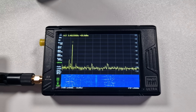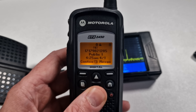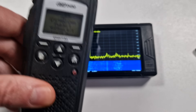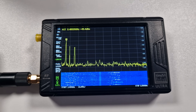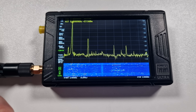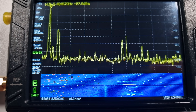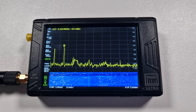Back to the Motorola DTR2450. How is this different? The best way to show you is on the spectrum analyser again. What we're looking at here is 2.4 gigahertz to 2.5 gigahertz — that is the frequency range these DTR2450s operate within. You might have noticed that is actually the same as Wi-Fi. So when we look at the spectrum analyser, look, we're not even transmitting anything yet and you can see this is just full of signals pinging around. That's because there's obviously Wi-Fi in the house on 2.4 gig. So if we just transmit on this radio now and have a look at the spectrum analyser, you can see it doesn't really look a whole lot different.